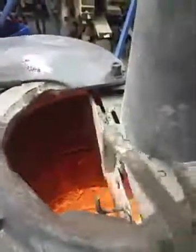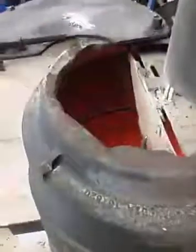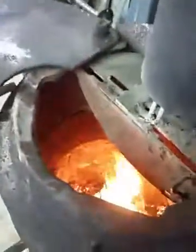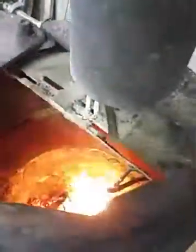It's just that for the flames to get to the chimney they have to go around the outside of the cast iron, heat up more of the pot belly, and therefore the heat that is being provided by the flame is just a lot more efficient. So if you want your pot belly to work more efficiently, use less wood, and it actually heats up a lot quicker too. If you want those things, maybe have a bit of a play around at making one of these.